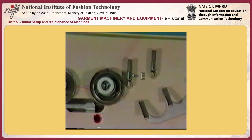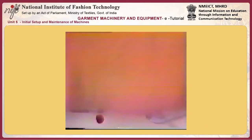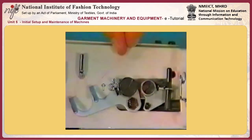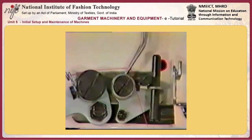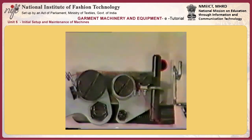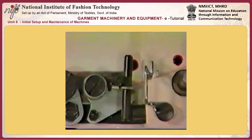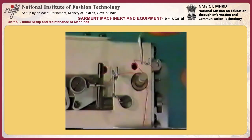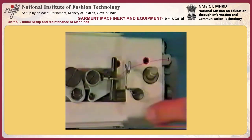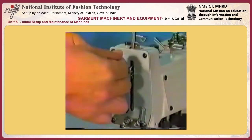L-shaped thread guide E. Thread pull-off lever F. Thread guide G. Thread pull-off lever nipper H. Number 2, thread guide I. Front cover thread guide J. Now, pressing the nut of the nipper releasing pin bushing, pull the thread towards you.